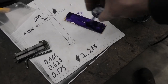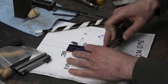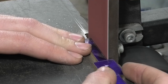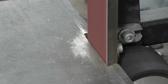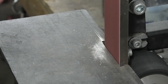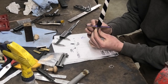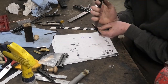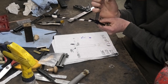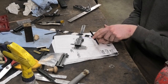So you have to watch me put blue layout dye on this. I'm just gonna check everything by eye to make sure everything looks lined up and square, and it looks really good. Mainly having the blade centered is super important. With the electrical tape it's gonna be weird, but 2.77 — trying to hit one layer of electrical tape — yeah, pretty close. This main portion of the guard looks centered to the ends of the blade, which is perfect.